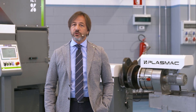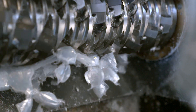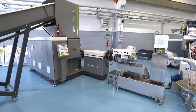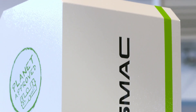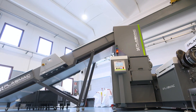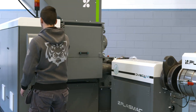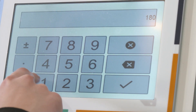As mentioned, the Omega is a shredder extruder combination. The shredder design is unique to Plasmac. The slow rotating shredder rotor generates virtually no heat and minimal dust, meaning it is not necessary to water-cool the rotor or to temper the system. The screen is also a unique design to Plasmac.